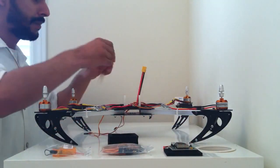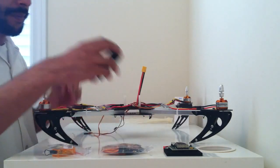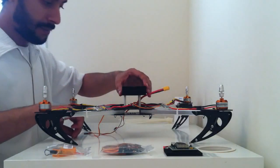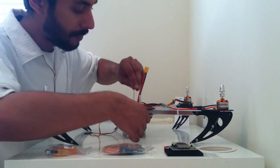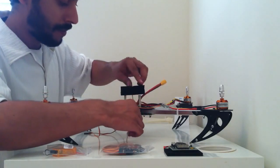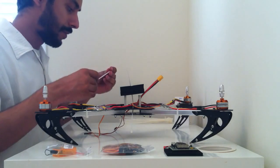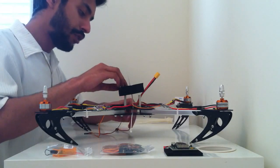For this we're going to need a few zip ties. I've already pre-drilled three holes to essentially pass my zip ties through, as well as one hole to hold the radio receiver in place. You can use the slots in the frame to pass the zip tie through. The nice thing about zip ties is that you can still use the folding mechanism that will not be inhibited by using zip ties. Before tying them down you want to make sure they're even on both sides.